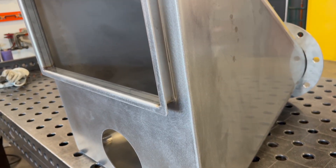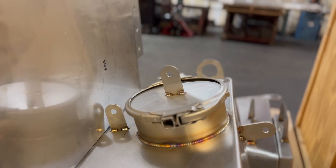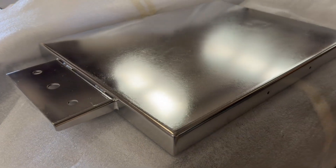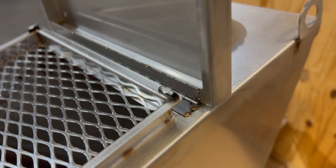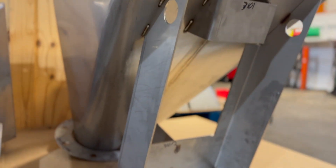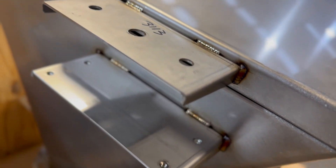These things came out looking pretty nice. Once we were done fabricating and blending the welds, we sent them out for electropolishing — a process where electrical current removes some surface material, creating a very smooth and somewhat shiny surface, which makes the product slip through the hopper better. The customer is super happy, and we love projects like this. It came to us as nothing but a really rough 3D scan of a similar part, and we love that challenging geometry. If you like what you're seeing, like and subscribe.